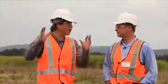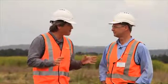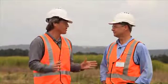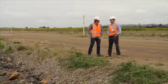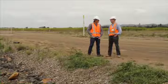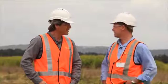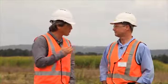This is not exciting bridges or wicks. This is just basic road building, but it's where you have to try to predict what nature does — and of course nature will always do what she wants to do. We've got four kilometres of low embankment here. Things have been deposited differently, different types of materials. So we monitor very closely with those settlement plates behind us and then respond according to what they show.